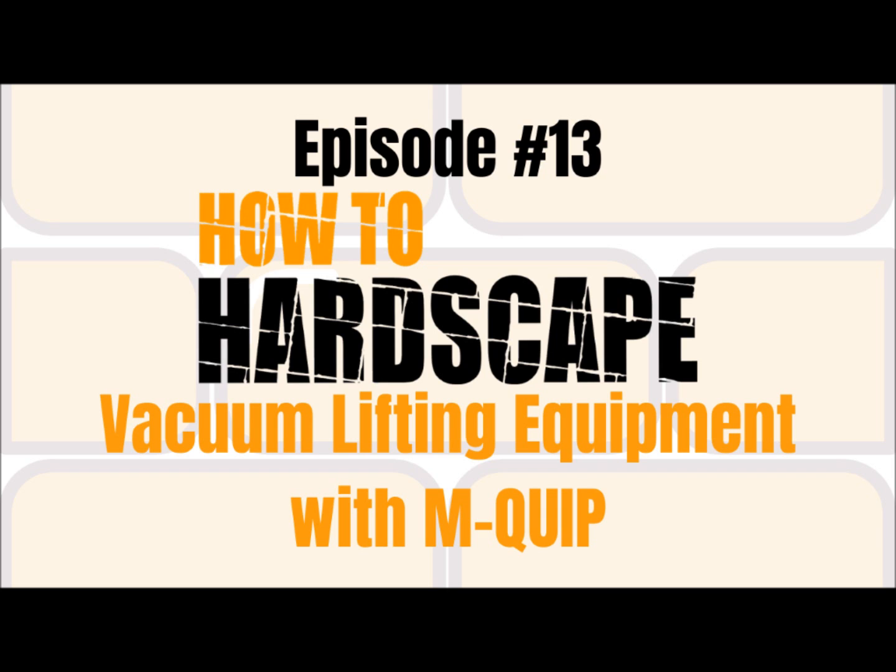For the most part, you can replace these seals — they're generally not expensive, but it depends on the vacuum lifter itself. Those are the two main maintenance items to look out for. When it comes to knowing when a seal needs to be replaced, it's mostly just visual. You'll see the seal starting to dry out, and at that point it's probably best to just replace it. You'll start to see cracking in the seal. You should get a full year at least out of the seal, and if your team treats it well, even up to two or three years.